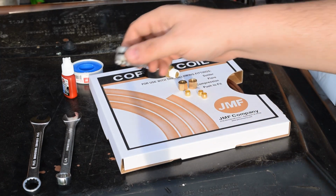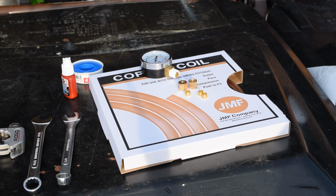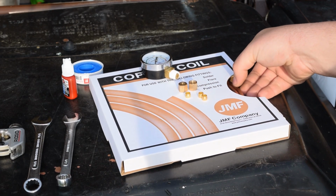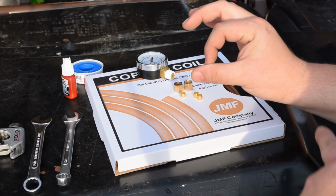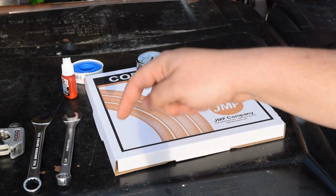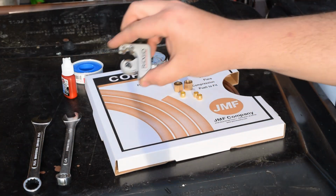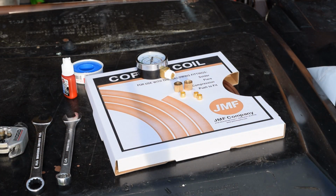to be able to cut our pipe without kinking it or compressing it, because what happens is if you use some other tools that are not designed for it, besides like a cutting wheel or something like that on a Dremel, that would work perfect, but you can't use pliers or like wire cutters because it'll actually compress and collapse the copper, and then when you do that, it'll actually oval it out. So when you try to put these on, they don't fit. So to save you the hassle, go ahead and pick you up the tool. It's very simple, very easy. They're actually pretty inexpensive, but let's go and get you reset back up.